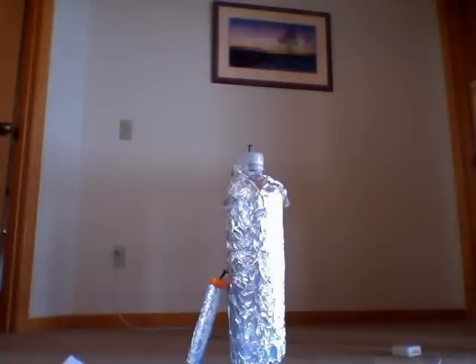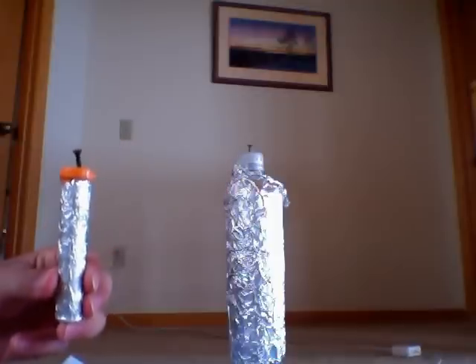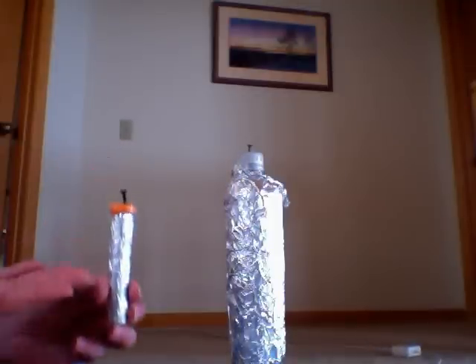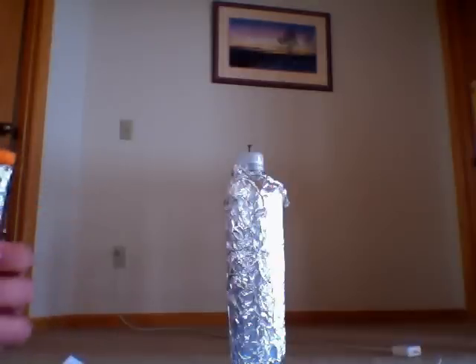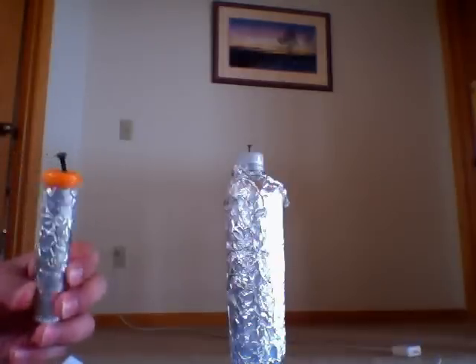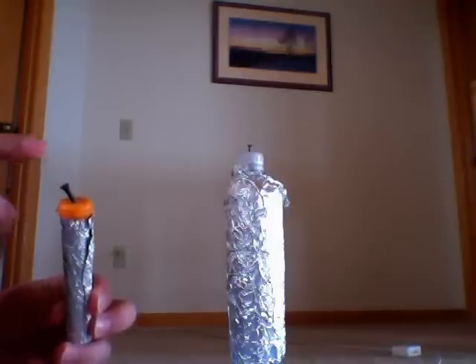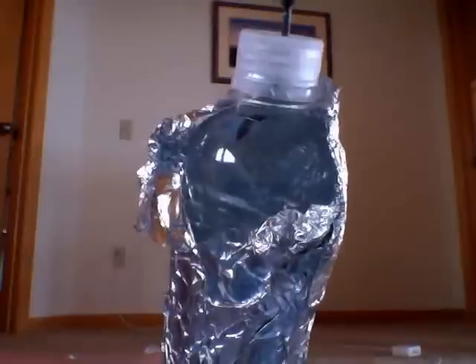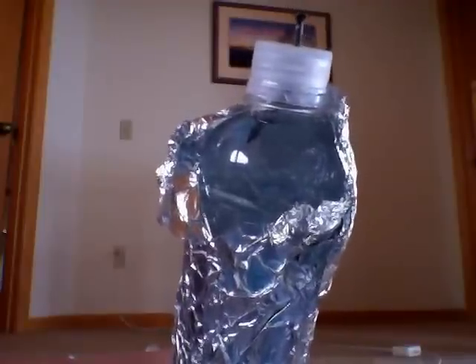Now that we know the origins of the Leyden jar, let's get started. The Leyden jar is essentially a large capacitor. It holds a lot of charge, whether it be this size or this size. You've probably noticed the aluminum foil wrapped around the container itself — it functions as an outer electrode. The nail that punctures the cap transfers the charge to the salt water inside. It is salt water because it conducts charge much better than just water itself. It doesn't have to be, but it works best.